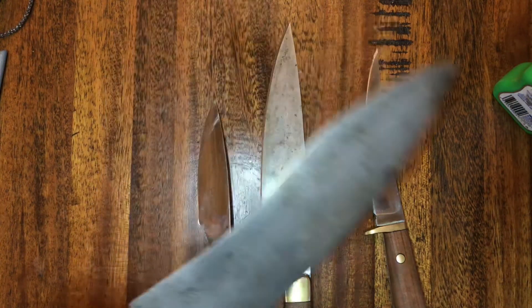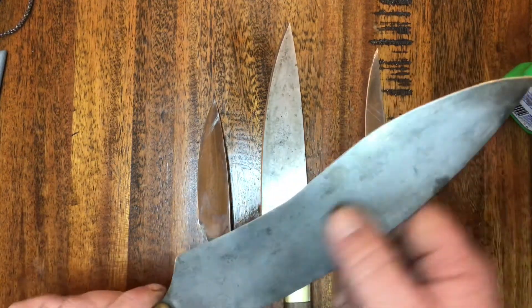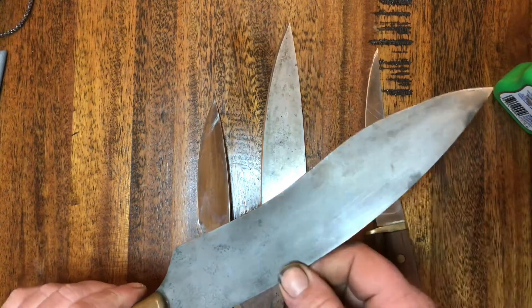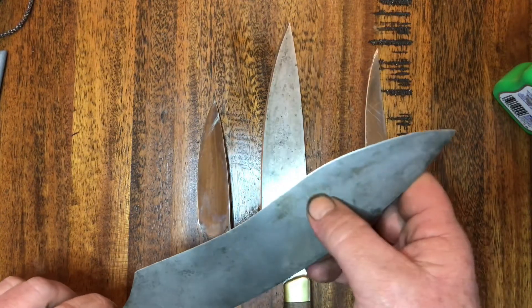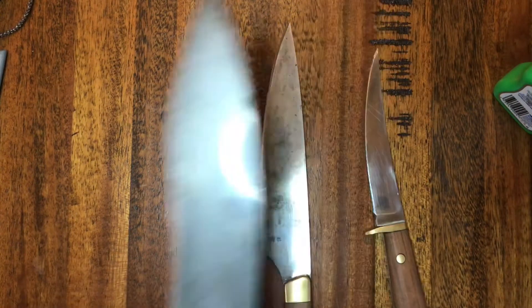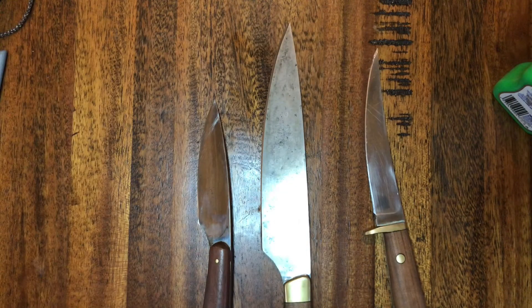This one was done all at one time - I basically wrapped it with a cloth soaked in vinegar and forced that coloration onto the blade. You can see there's a couple of deeper spots, a couple of brownie spots, but mainly it's gray. Originally carbon steel knives were called black steel knives - old butcher knives and that sort of thing tend to be black steel knives. They color up with use, so over time they gain the color.